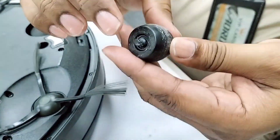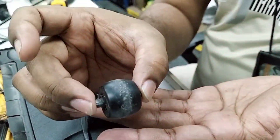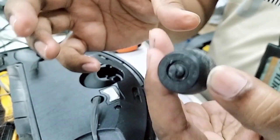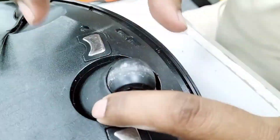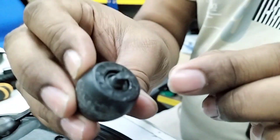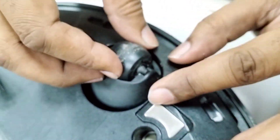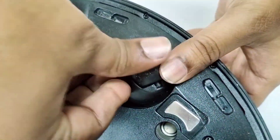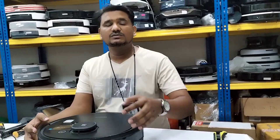The same way, take out the roller from your new assembly that you purchased. When you take out the new roller, put it back here. You can see the shape — one side is thicker and one side is very thin. The thin side goes in first. Put it like this and then just press to lock from both sides. That's all.